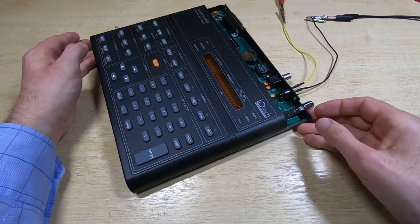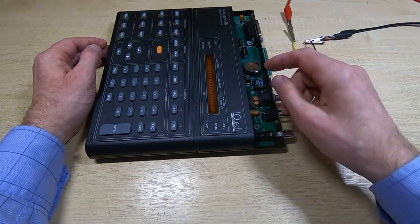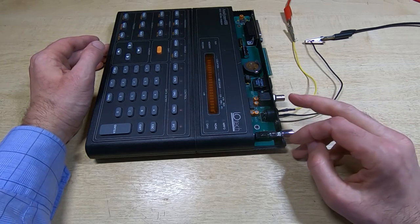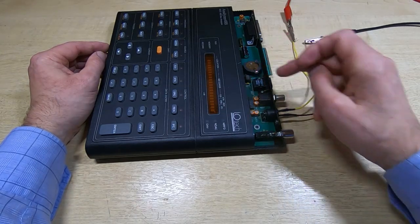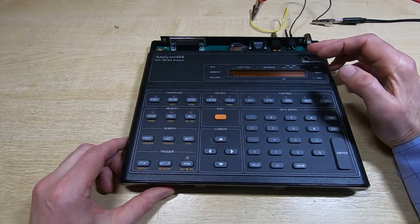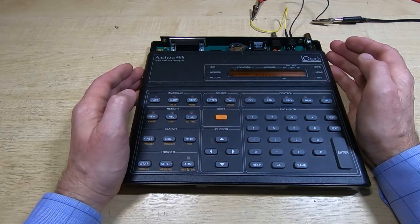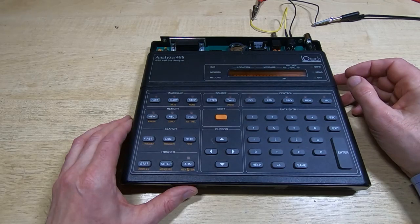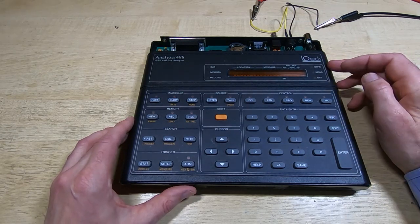The issue is that if we power this back on - and I'm not going to - the reason is that the device that was fitted, which was soldered to the board and which I've now fitted in a socket, is not providing any power to the RAM chip. At first I thought that just one of the three chips would be battery backed. This is a DS-1210 - a simple CMOS battery backup controller. What it has inside is a couple of steering diodes: you apply main 5-volt power to one input, you apply the voltage from the battery to another, and that decides which power source is used to power the RAM chip.